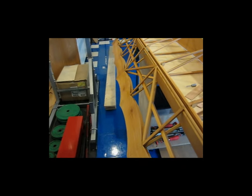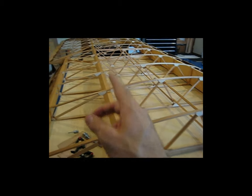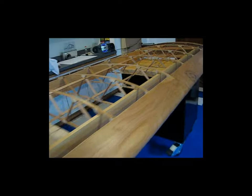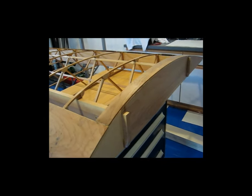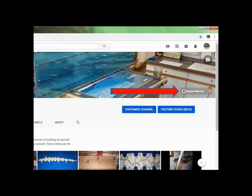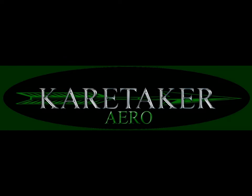Next up for me is to put the horn on the aileron, and then start my drag cables and various wing strut attachment brackets, and the brackets to attach the center section — all that so I can start fitting this to the center section and fitting everything wing-related to the fuselage. So that's the ailerons. See you next time.